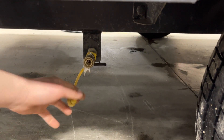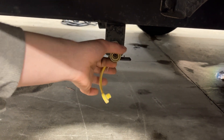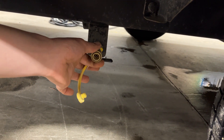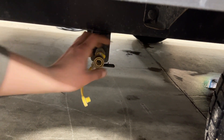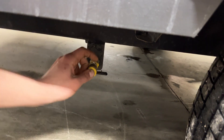There's the propane quick connect down here, so if you're looking to tie in a barbecue you have the power to do so. Basically you're pushing back that quick connect collar, attach your hose, walk it into place, then you have that valve there. Open up that valve — with that valve open, you cannot undo the quick connect, so it's just an added safety feature. Put that dust cap back in there whenever you're not using it.